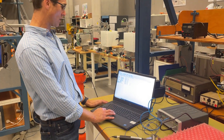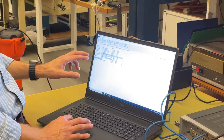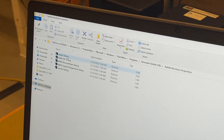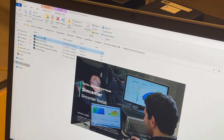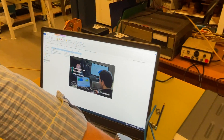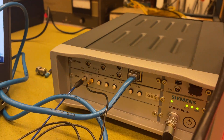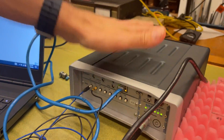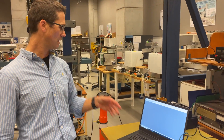You double-click that one and it basically opens Windows Explorer. For doing a measurement campaign, you're going to use a structures acquisition folder. Within there we've got some options — impact testing or spectral testing are the most interesting. We're going to do an impact testing project. I'm going to double-click the impact testing hyperlink, and that's going to start to open your new project. You'll see it starts to communicate with the hardware — the LAN cable is now flashing — trying to communicate, because this system is going to digitize our analog signals and send them through to the laptop.